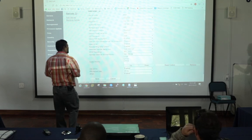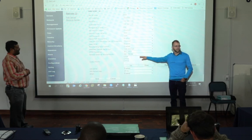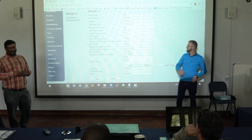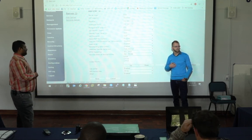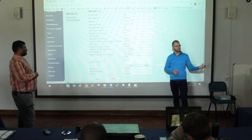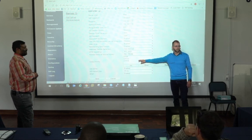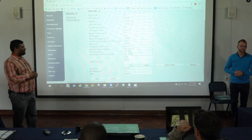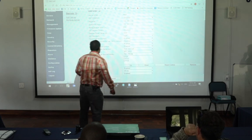The reason why we keep the others is, for example, on our entire network we prefer 729. However, you get other ISPs who prefer 711, and they send their call to us on 711. Now, if one device phones the other device, it's called a user agent. So user agent one talks to user agent two, and they may want to communicate on a different codec. So we rather keep them in, so that they will negotiate on the language. Yeah, ULAW and ALAW.